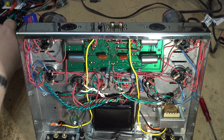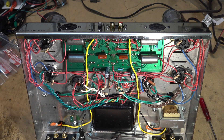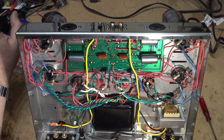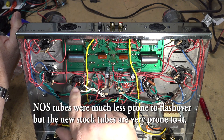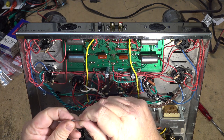It's not just these units — any unit that uses a vacuum tube rectifier is susceptible to this. There's an easy fix and it requires just moving a couple of wires on the tube socket and adding a couple of high voltage silicon diodes.